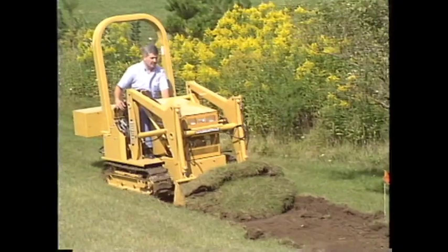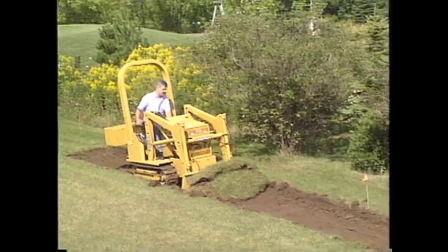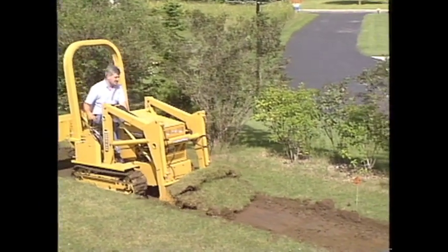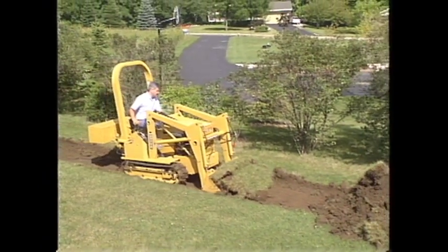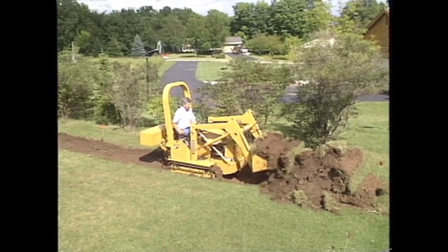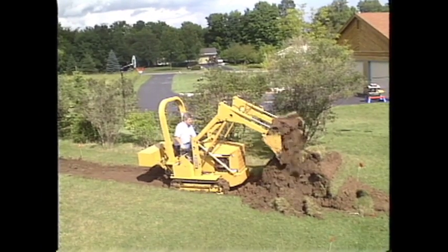In this demonstration, an excavation 40 feet long by the bucket's 4-foot width has been excavated to a depth of approximately 6 inches in a measured time of 6 minutes and 18 seconds. Note how the operator holds his bucket level as he makes his final pass to square his excavation. Hitting an obstruction, the Magnatrac HYDRO uses its reserve power, cutting through cleanly and actually moving more material than its bucket was designed to normally handle.